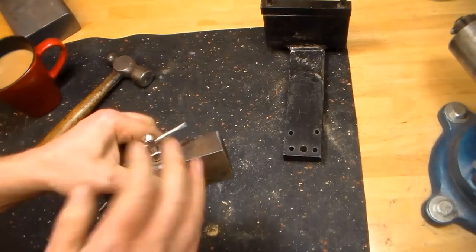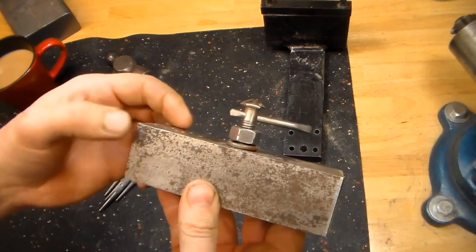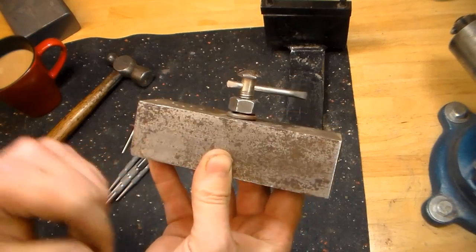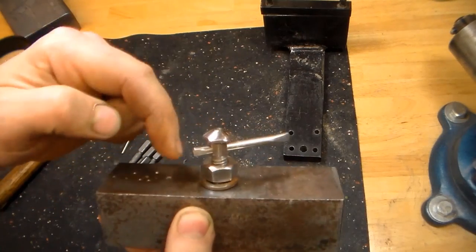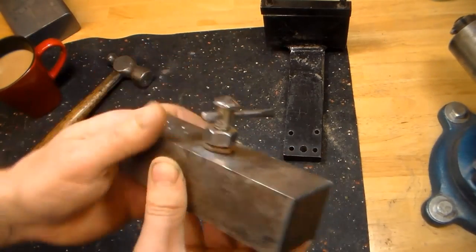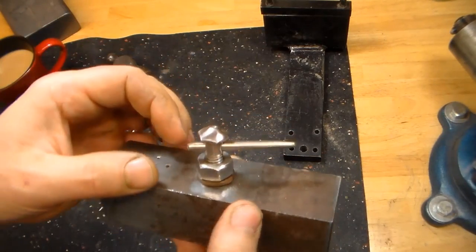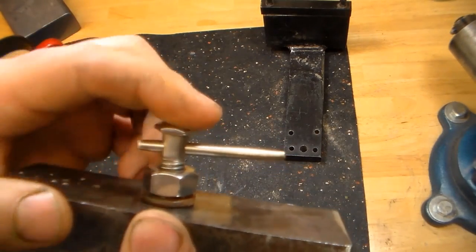To support the pin while we're hammering on the top side of it, I made this little adjustable post anvil. It's just a heavy block of bar stock — the same size as the KMG tooling arms. I've got a 3/8-16 stainless steel bolt that I drilled and tapped a hole for, so it threads down in there. I've got a lock washer and a nut, and I put a sliding T-handle through here like you see on a C-clamp, so I'd need one less wrench. I rounded the bolt head off and polished it.